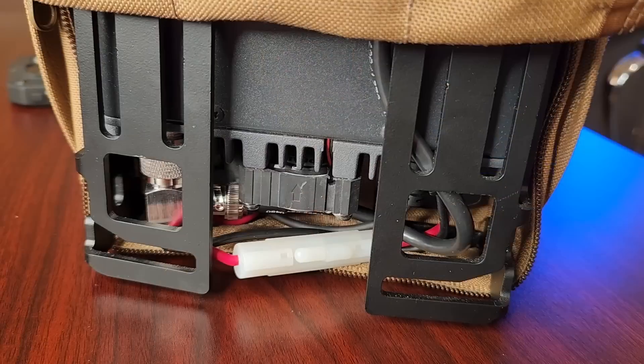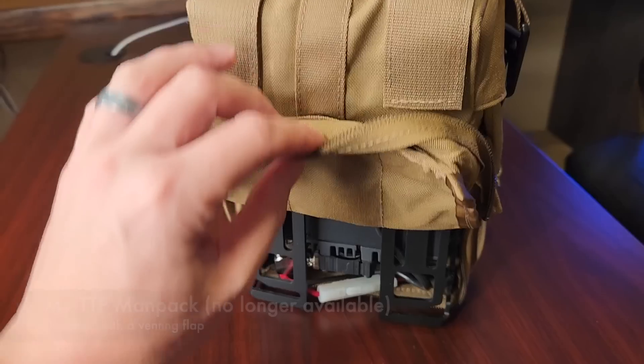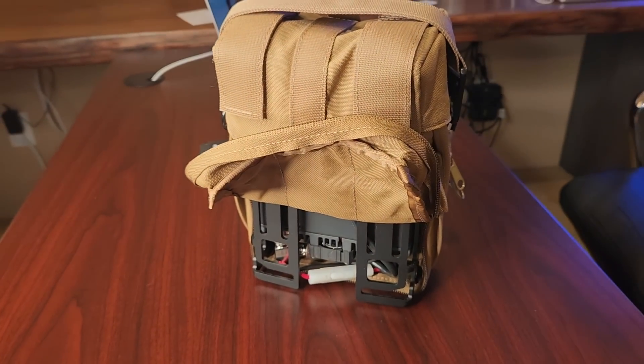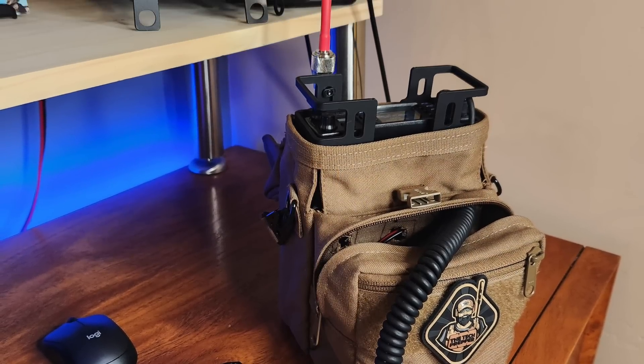The only thing to keep in mind is that I personally run my manpacks in bags, so you need to be careful of heat buildup. I've never really had an issue because I don't rag chew — I like to have targeted conversations and turn off the radio after use, or listen on receive more than transmit. For the home setup, I have a feed line coming into the shack and a couple of VHF UHF antennas on the roof. That also works perfectly fine at full power, though again be cognizant of heat buildup in the bag.